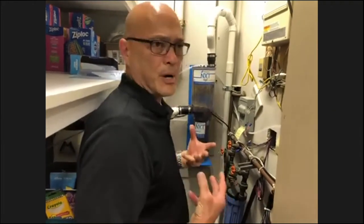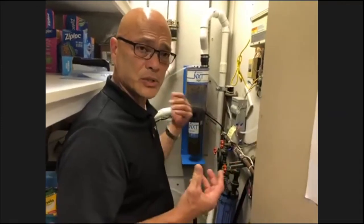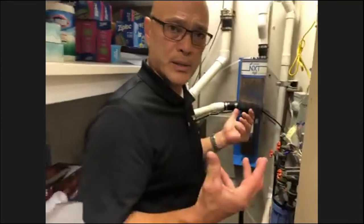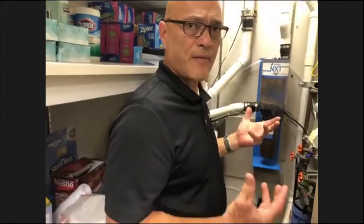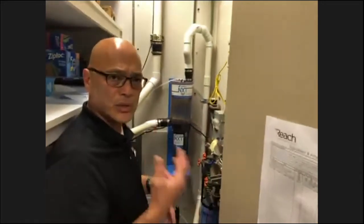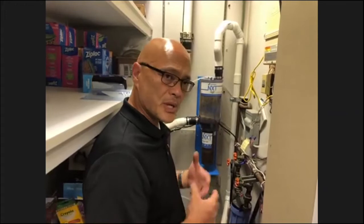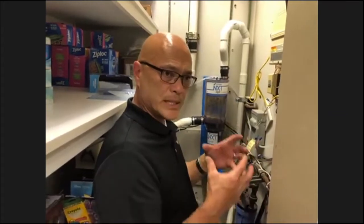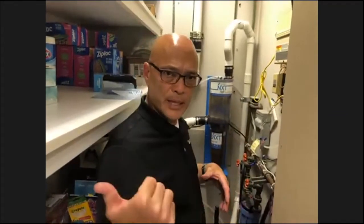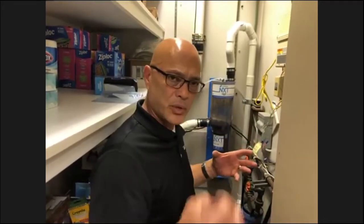This particular office has what they call a dry vac system. There are two different vacuum systems: a dry vac system and a wet ring system. The dry vac system doesn't use a lot of water because it doesn't need that for cooling like the wet ring pump. And this office has them separated, so the noise and the heat is in another mechanical room. That's where the motor is, and that just creates a suction.